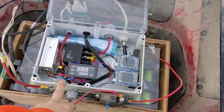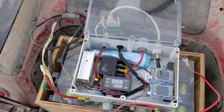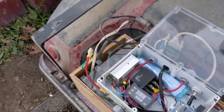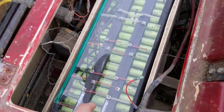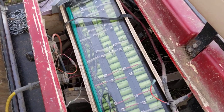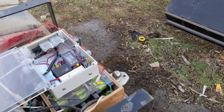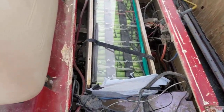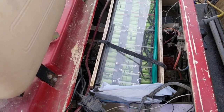I put this thing together last summer. Currently it is November 2020. I got this thing going in the spring of this year with lithium-ion batteries. The original batteries are done, and I acquired these A123 cells from BAE Systems. They came out of a TTC hybrid bus and I got the sarcophagus of these things out of that bus at a scrap yard for a very good price — not just the batteries but a whole bunch of connectors and wiring as well, and contactors. So essentially I upgraded this golf cart to be lithium-ion for the price of scrap.